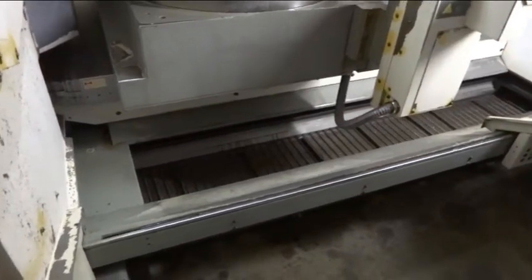So longitudinal to the machine base. Yeah, that's the best. Another one is down here, that's the third one. You see here we have wood blocks, so we have the machine straight in the warehouse like you guys saw. Also put that, most of them out, so that the chip conveyor will pass in and out very easy when you have the machine level, and then you can put the chip conveyor all the way in.